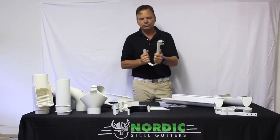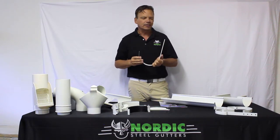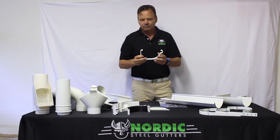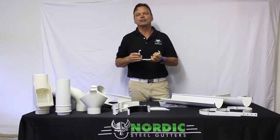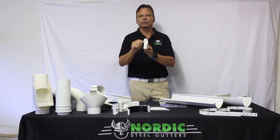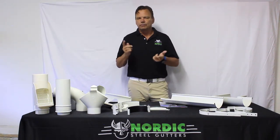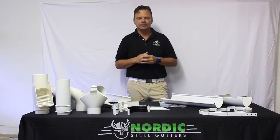The hangers are extremely sturdy — they are classified as heavy in the testing. We actually test them with 175 pounds hung on the tip of the hangers and measure the residual deflection, and the deflection is less than a sixteenth of an inch. Basically it comes down to what substrate you put it into. Another nice feature of the fascia hanger is that it has one circular hole and one oval hole. The idea is to place the screw through the circular hole first, then you can adjust it slightly if you have a knot or something in your fascia board, which makes it very versatile. You don't caulk the system, you don't put any rivets to connect it, you don't screw it together. The only time you make a hole in the system is when you make the hole for the outlet.